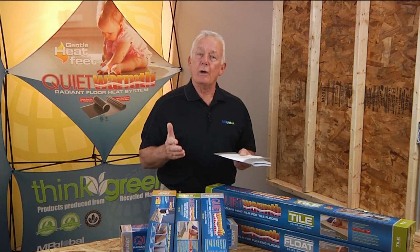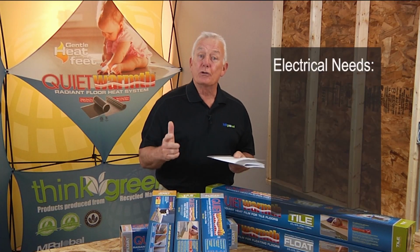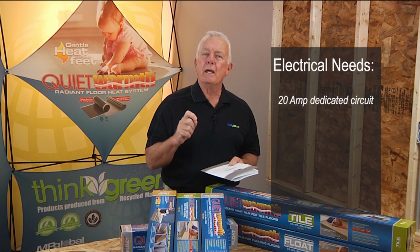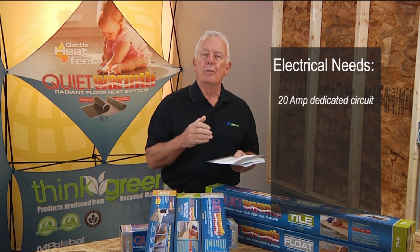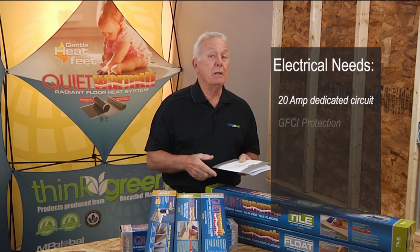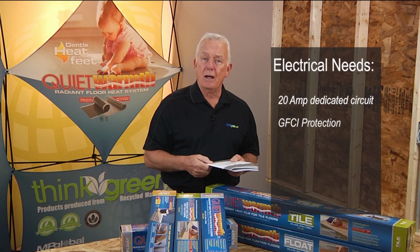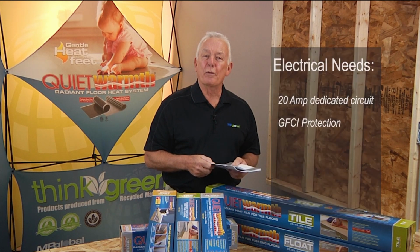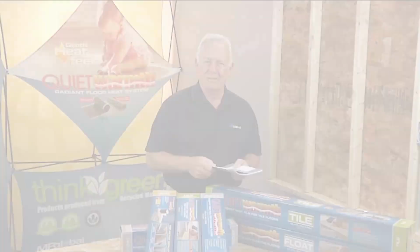You'll need to plan where you'll hook up the leads to your 20 amp dedicated circuit. A licensed electrician will be able to help set one up from the main electrical box. The QuietWarmth system does need to be protected by a GFCI, which thoughtfully is incorporated into any of the QuietWarmth branded thermostats.